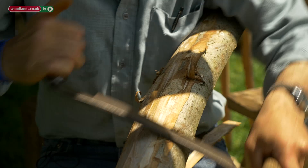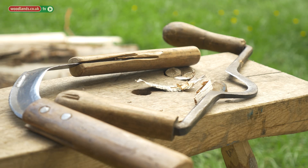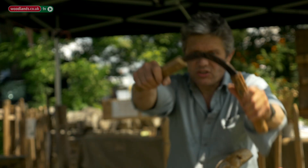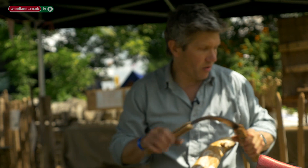With two hands on a draw knife you can do very little damage to your fingers. The classic thing is you take the tool away and then start swinging it around and your thumb gets in the way, so just keep your hands away — and other people out of the way as well. Another tool I use for peeling bark is called a rinding knife — you can get generous dual removals of bark. I've also got a slightly smaller one, great for smaller diameter poles.